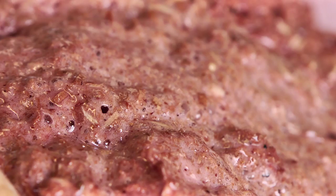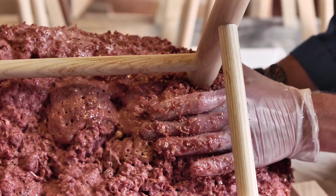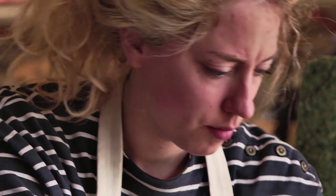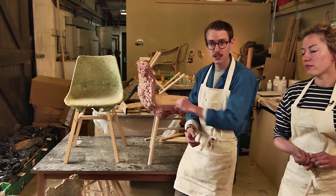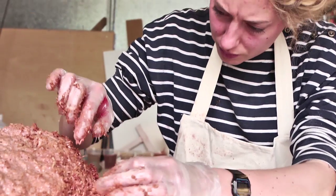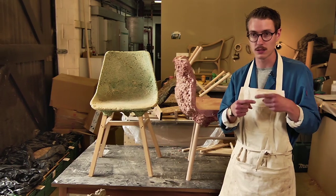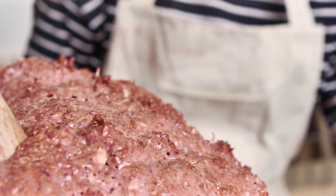So we have a selection of different kinds of wood chips that we can play around with to create a perfect mixture — like a recipe. You take very fine sawdust for the surface texture, you take the longer grain for the strength that it gives, and then you take a more curled chipping from a planer, which traps air and helps with the expansion.